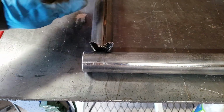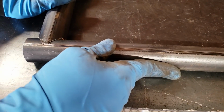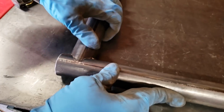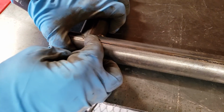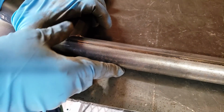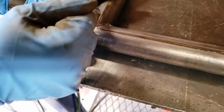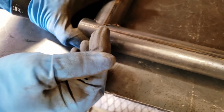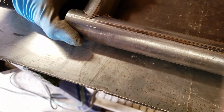As you said, what we're going to do is we'll pull this down. We'll put it in here, and this will give us a 1/4 inch on each side overhang. So we'll get this welded up, and then we'll come back. This will actually be, see, this whole thing is 36¼, we measured it 1/2 inch wide, so it's 35 3/4 from outside to outside.